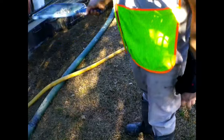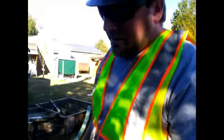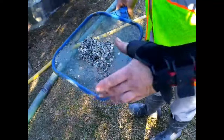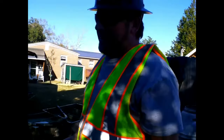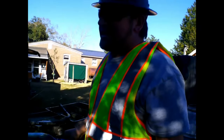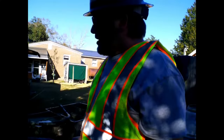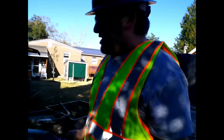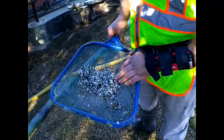How hard do you have to go? Where do you go now? This layer of limestone in this area is pretty shallow. It's usually only about 30 foot thick. So we hit it at 16, 17 feet. It got hard at about 25. So this is 36. We just cut 10 foot out of the bottom of the 6-inch of virgin rock.